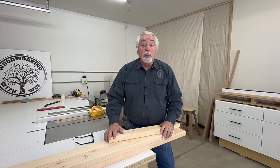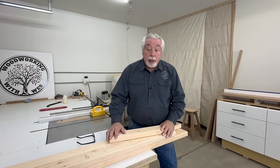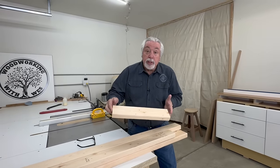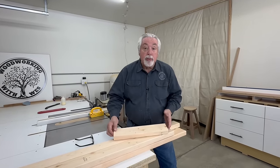The material we're using for our planter box will just be two-by-fours purchased from our big box store. We've determined that we want to build it 17 inches square and 15 inches tall. Our two-by-fours are going to be cut to 17 inches in length first, and we're going to go to our miter saw for that step.